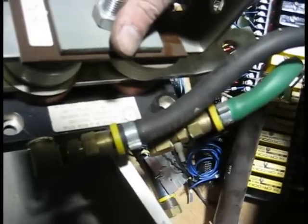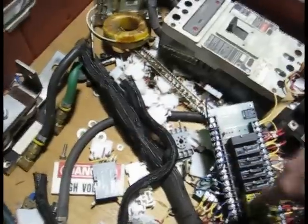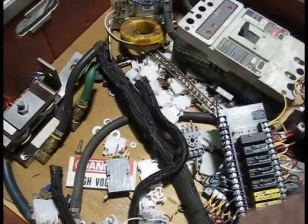This nifty thing, which I'm not entirely sure just what the hell it is, but it's water cooled and it is a W/C unit, which I'm guessing means water cooled, and it's a Medar part number, so I'll look into that, but it looks to be some kind of SCR or something like that. I'll look up the numbers here, which are Semikron SKT520/20E, and a little symbol there is a diode with an extra wire, so I'm guessing these are some kind of SCR. We'll see how that works, but that's screaming big power switching, and it might be useful for a future version of Thumper or something like that.